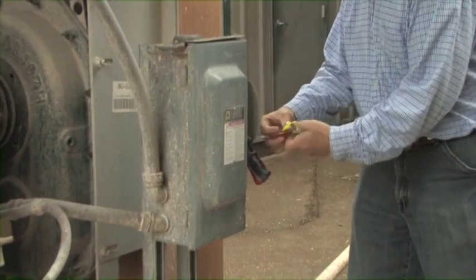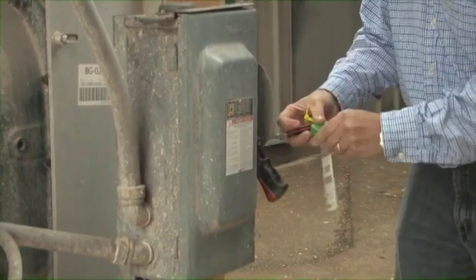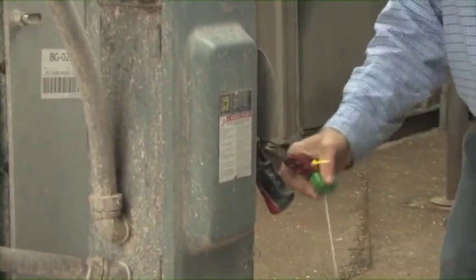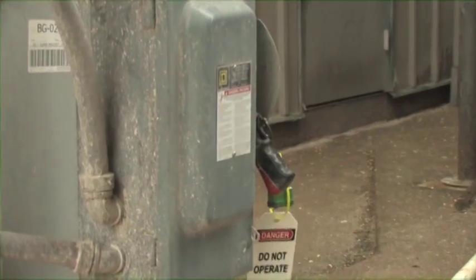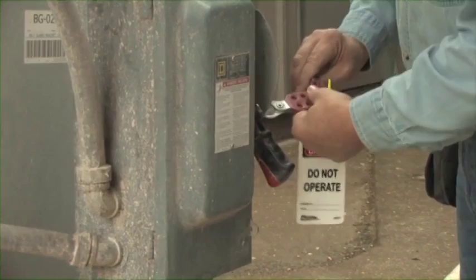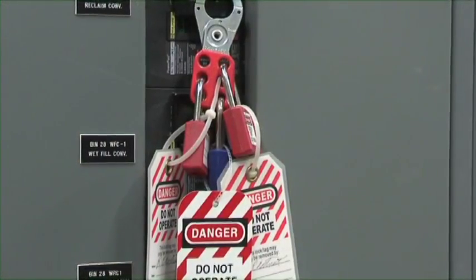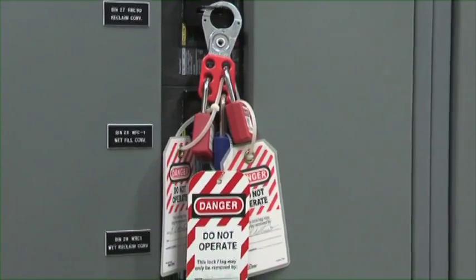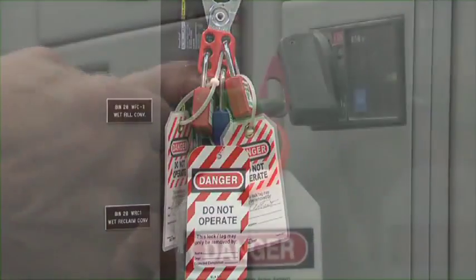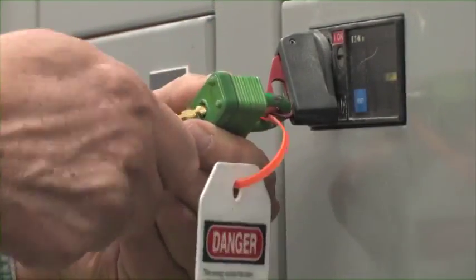After shutting off the discharge auger, shut off the leg that could dump grain into the bin. Locking out consists of placing a lock on the power source that is clearly identified by owner, recognized for lockout tagout use only, and can't be confused with a security lock or other common padlock. Tagging out involves placing a tag identified by owner on the energy source to notify others it is locked out and non-functional. If multiple people are working on a piece of equipment or entering a bin, there should be one lock for each person — no person's key should open another person's lock.